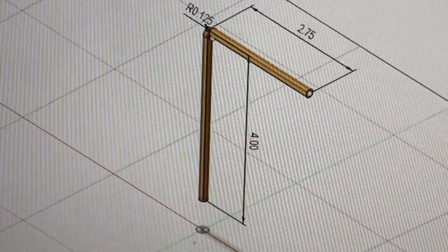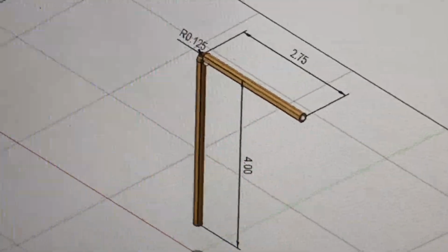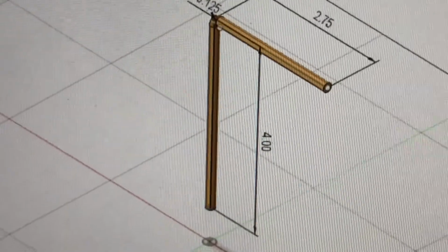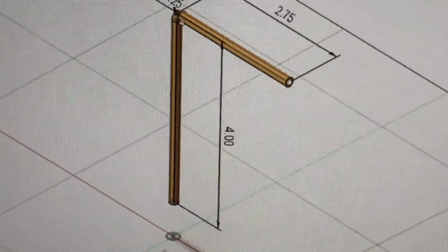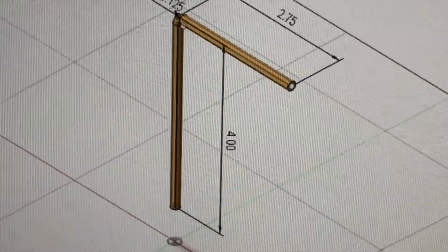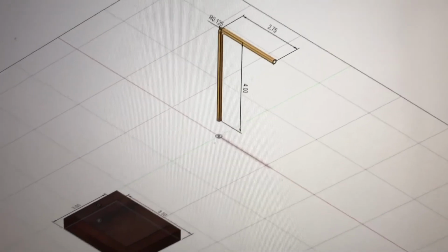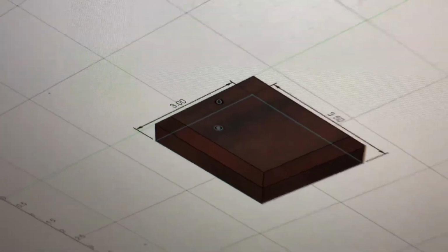So I got some 3/16 brass rod, and we'll put a slight radius on it here, like an 1/8 inch radius. I'll just clamp it to something small, and we'll bend it around it. We'll vice grip it or something, and we'll make the radius here. So all we got to do is insert that into the hole, and that's it.